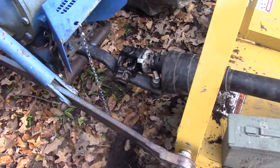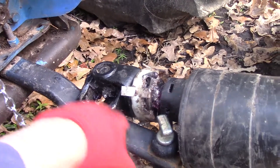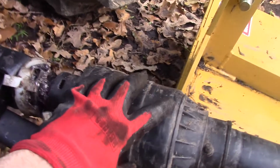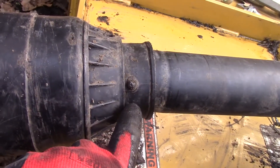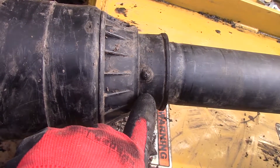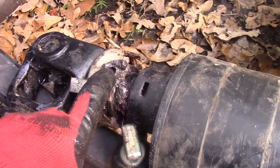Getting back to my rotary cutter — you can see there is a zerk fitting there used to grease the universal joint, and here is my plastic bearing that I have manually greased. Here is the bell housing of the PTO shield, and on this bell housing there is a plastic zerk fitting. It's plastic and they break all the time. If you grease it as frequently as you're supposed to, you'll likely break it. That's the reason I disconnect all this so I can manually grease it every time I take it out.